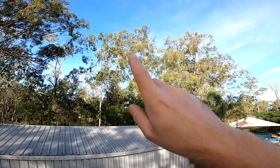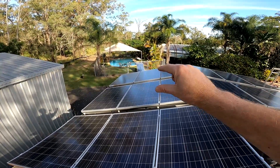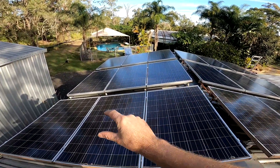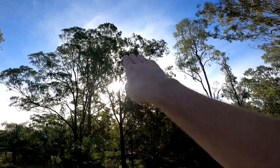In summertime the sun will be almost straight above us and we'll have so much sunshine. These two original strings are making around 6 kilowatt hours a day, so if that's 6, the new string adds another 3 — that's 9 kilowatt hours — so it will be over 15 kilowatt hours a day. That's essentially one full battery cycle just from solar in summertime. We've got about 23 days until the lowest sun angle, and from then it will go up again.